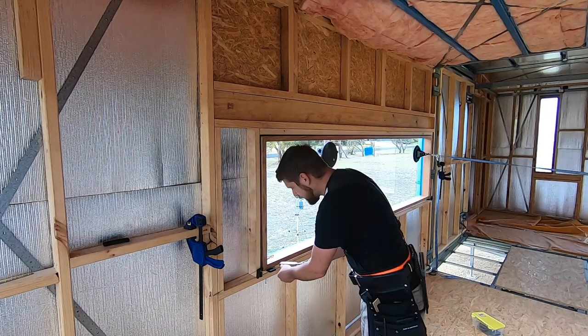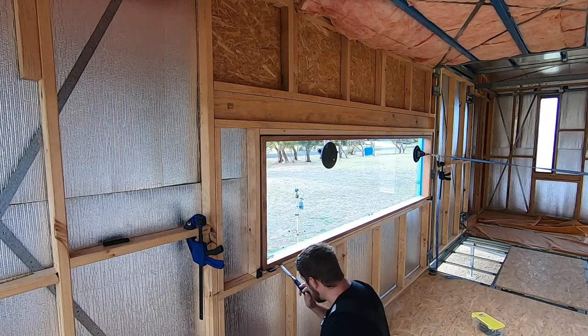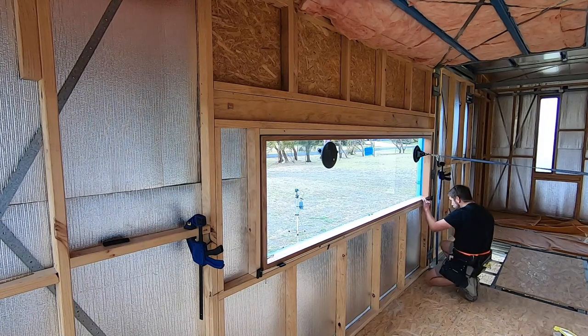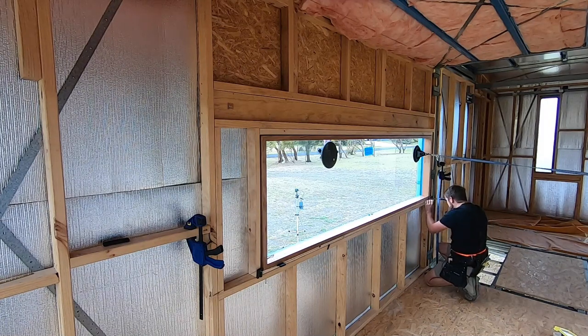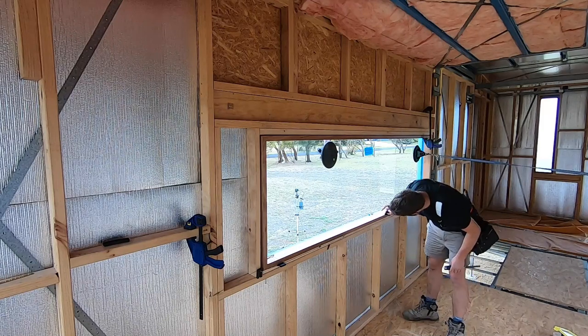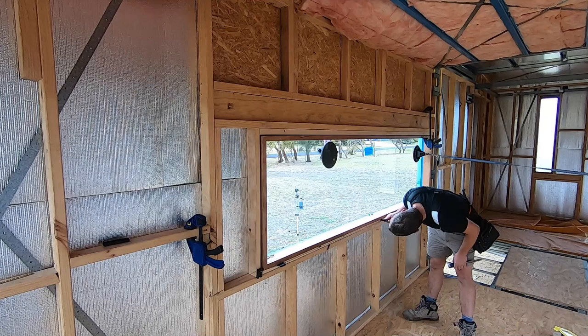All I have to do is get the chisel underneath there in the gap and open that up, and put a packer in there. So I think I need to lift this end a little bit as well. Chisel in there, lift him up. Now when I run along there, I've got it screwed down the middle so I can't lift up, put that packer in, it's spot on.